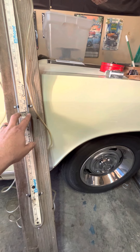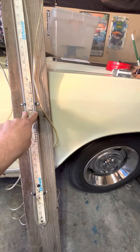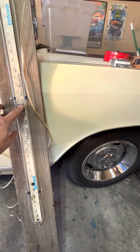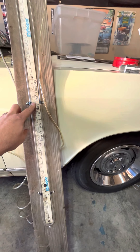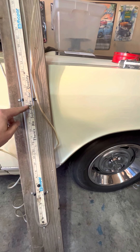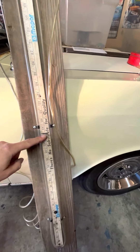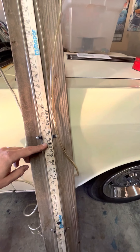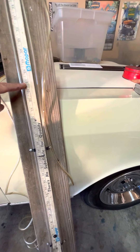You basically start with a level — both your tubing, the water leveled on both sides — make your mark, then hook up your one vacuum tube to your rear throttle body. It's probably going to be somewhere in the area of one or two inches of water as soon as you hook it up. Since you started at zero, you're going to adjust it — turn your idle screw or minimum air screw on your rear throttle body in until you see a six-inch rise in water.